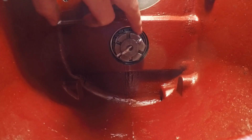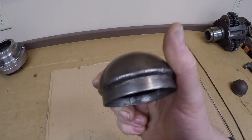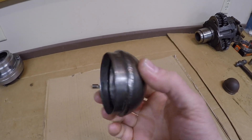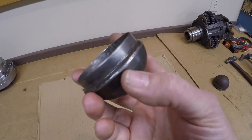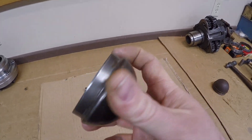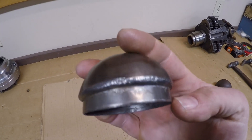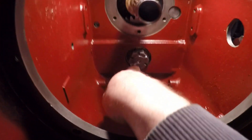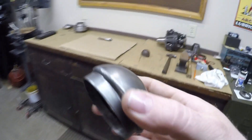The fit is nice and tight — it's not going to rattle around in there causing any kind of wear or break any of the legs off. The next two pieces going in are on the bench. We're going to focus on this one first. It looks kind of like a mushroom top. This is basically like a wheel bearing cap that goes over the end of the hub and seals the wheel bearing, protects the nut and the pin and all that. This one is actually handmade — you can tell this is X-231's original one. It looks like they torch welded it, then bent a flat piece of steel around to provide a friction surface. This piece goes in the transmission and covers over the top of the nut on the end of that pinion shaft. You wouldn't think it needs to be there to seal anything, but you'll learn why in a minute.